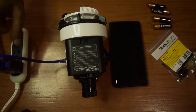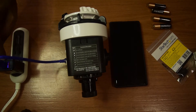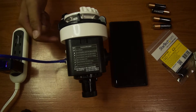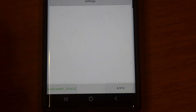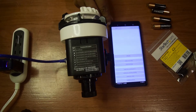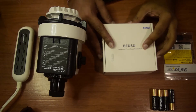I've switched from fast charging to one of the normal power ports, still connected to the Star Adventurer via mini USB. I turn it on again to app mode, and as you can see it now shows 4.91 volts. So when powering up this module using a normal mobile charger port, it runs at 4.91 volts.